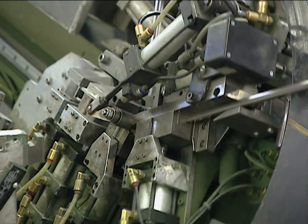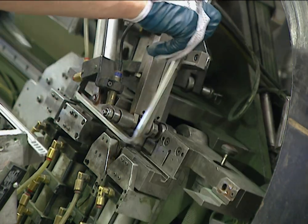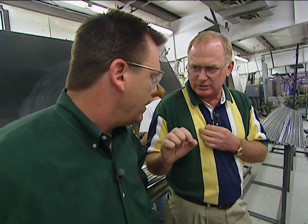Stainless steel is more expensive than aluminum, which is used for many spacers, but it's preferred because in cold climates a cold edge at the sill of a window creates condensation. Stainless steel reduces heat transfer from inside to outside the window — it's about one-eleventh as conductive as aluminum. This increases the temperature at the sill, reducing the ability for water to condense there.